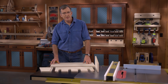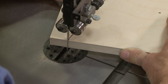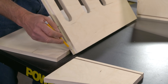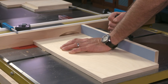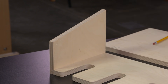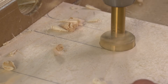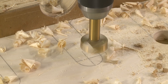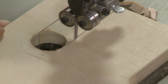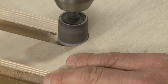I've completed a couple more operations on the charging station. On the ends, I've made an angled cut over on the bandsaw. With that done, I moved on to construction of the tool rack. The first step was to cut a rabbet on either end and carefully fit that by creating a tenon to match our end pieces. I then laid out these slots which are going to hold our cordless tools, cutting them by first drilling an inch-and-a-half hole at the root of each slot, then going to the bandsaw to remove the waste, and finally using a sanding drum at the drill press to gently smooth all the contours.